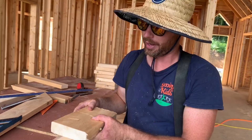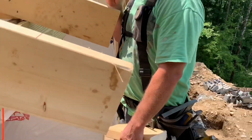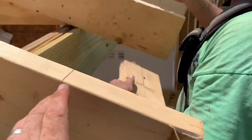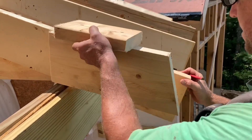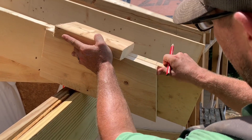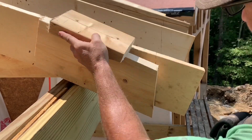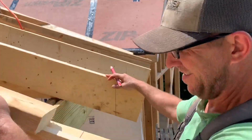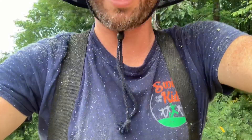I'll set this board on top of my rafter and trace the line — that'll be my plumb cut on the rafter tail. My associate Jason has the jig now. We've snapped a chalk line across the tops of all the rafter tails where we want them clipped, and he'll show you how to use it: simply set it on top of the rafter, run it up to your chalk line, and mark — no torpedo or speed square required. Thanks for watching, see you on the next video.